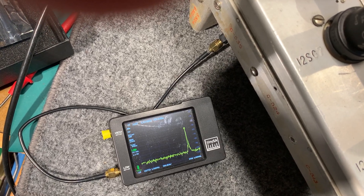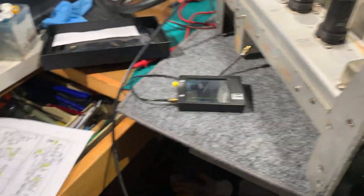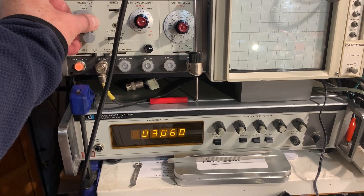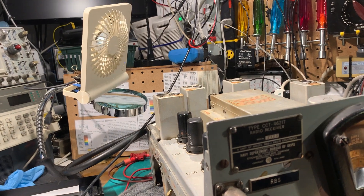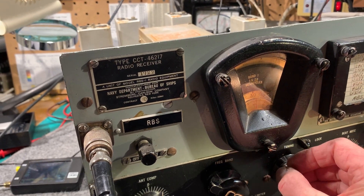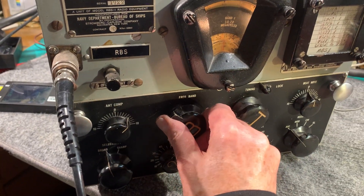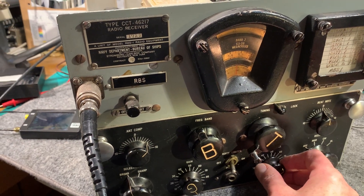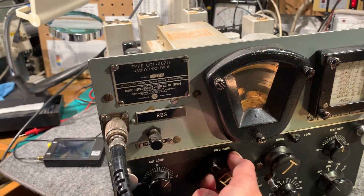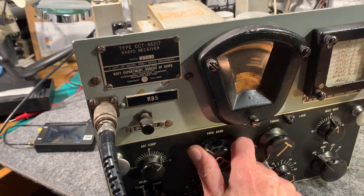Try tuning it - that's working. So I've got the signal jenny, this one's tuned to approximately 3 megahertz as well, and I should be picking something up. Let's tune to 3 MHz - nothing. There's much more activity on band two. Perhaps there's a fault on band one. Sounds like a dirty switch or something. I'll clean the band change switch tomorrow.